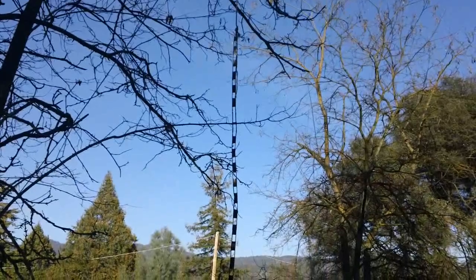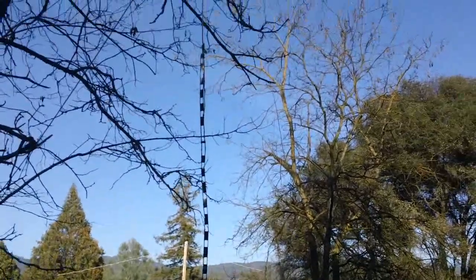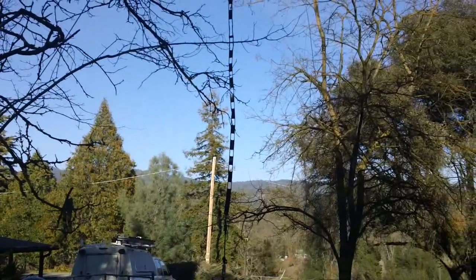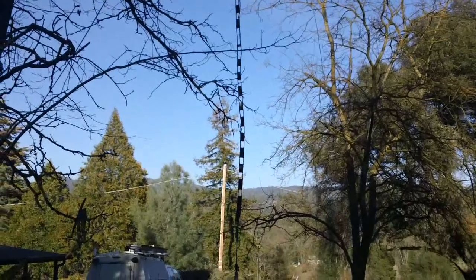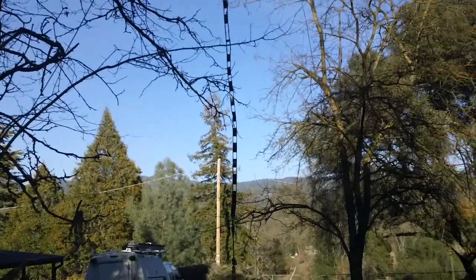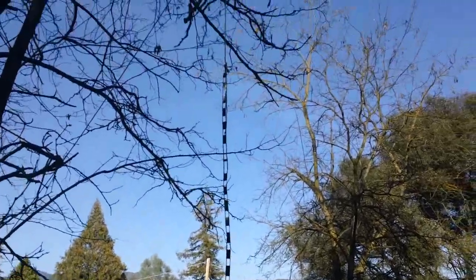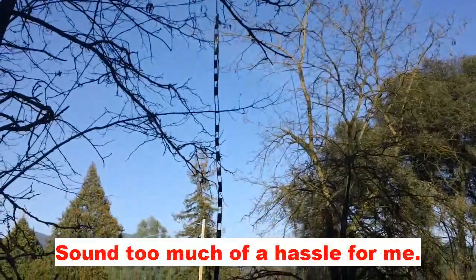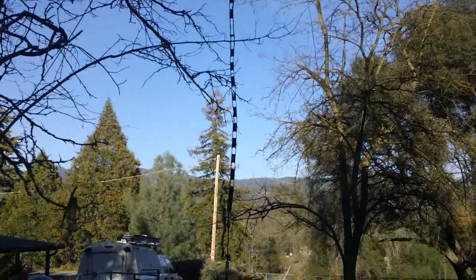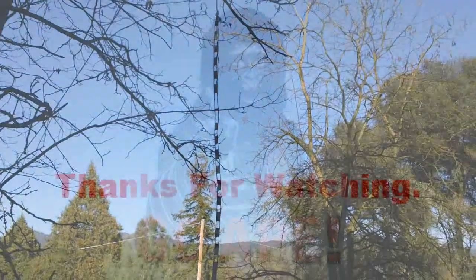If you really want maximum performance out of your Slim Jim antenna it has to be free-hanging like this for efficient transmission. I'm going to do more tests on configurations — next to buildings, trees, and pipes — to find the minimum safe distance from obstacles. But scratch the idea of using pipe enclosures unless you want to re-tune the antenna to work in conjunction with the pipe, because straight out of the manufacturer it'll detune and you won't get the performance. Gorilla Geek going 10-10, we'll see you soon.